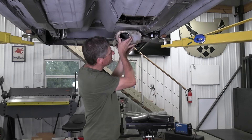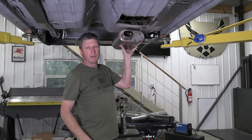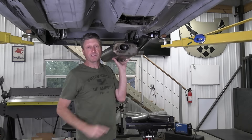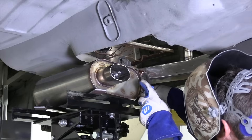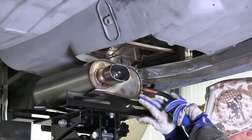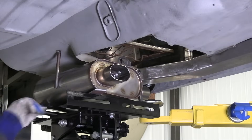With oval tubing, it's a little trickier to work with because you can't clock the tubing to make it fit better. I found that if I mount my X-pipe and muffler solid to the car with some temporary tubing, it'll be easier to make those small cuts and adjustments to get it just right. I'm fitting these in place with some small drop-off tubes from my scrap pile and tacking them with the Multimatic 220 set for 16 gauge.